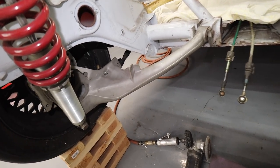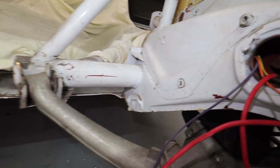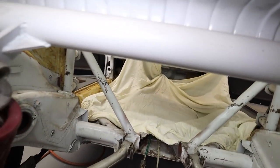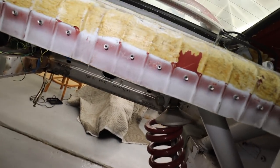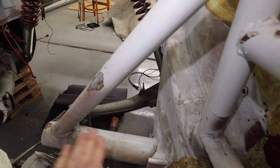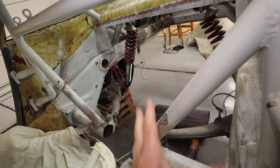Underneath the car, all of this white area — I have to grind, because I have to create an area that I can weld to, which means all these rivets have to go. Everything on the front side, all the rivets on that side. Basically what I'm going to do is build in a steel section that separates this passenger compartment from the engine.